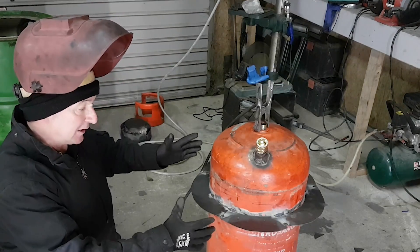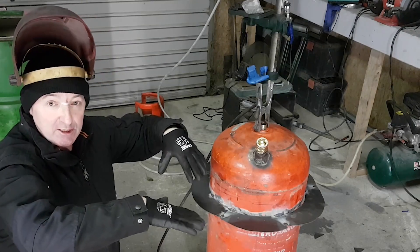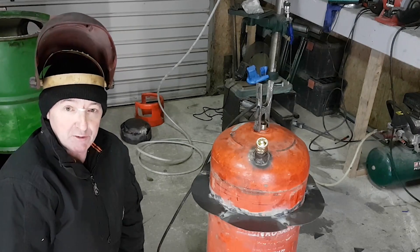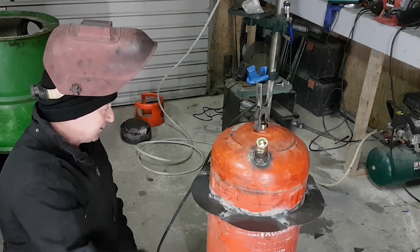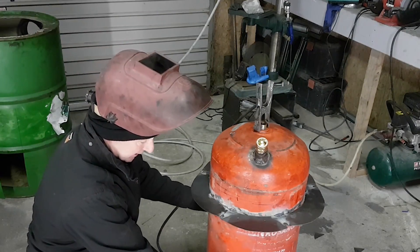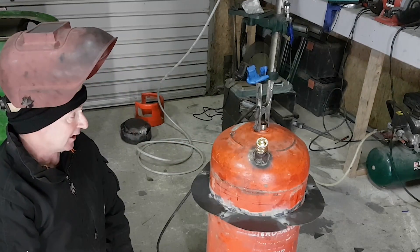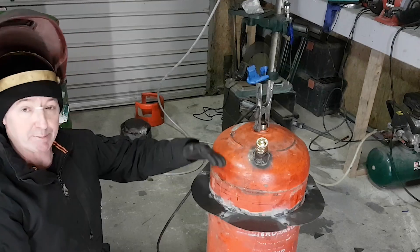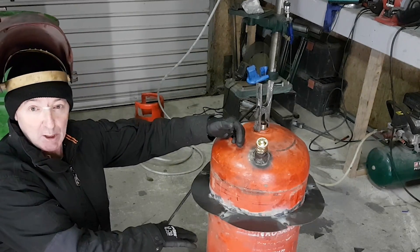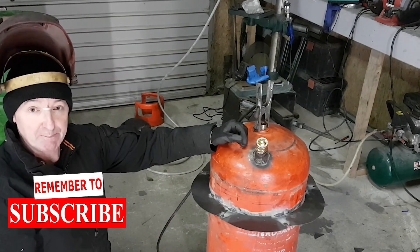This is like a skirt — it will allow me to put that down through the hole in the oil drum and it stops it falling down inside. It also acts as a seal because I can put screw holes through this, put a bit of fiberglass rope between the two, and that's a perfect seal. The flames and hot gases are going to travel around this, and this little fella here is going to be full of water — the theory is it'll get red hot. If this was insulated, the bit sticking out above the oil drum wouldn't matter.